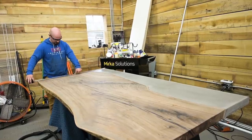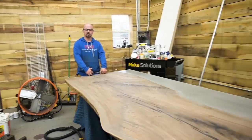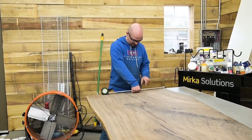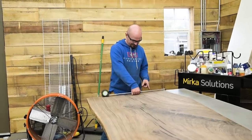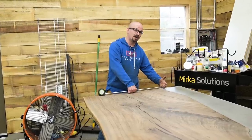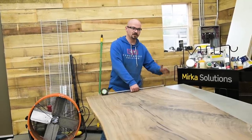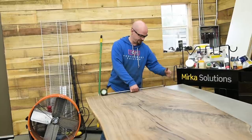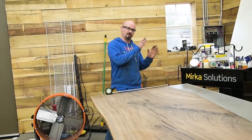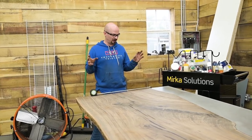So 44 inches — I can come in to 22 — this is my center. Because my base is 25 inches wide at the bottom, I basically have a 12.5-inch window on either side. According to this, my center of gravity is five inches off from the center of the table. The edge of the base on the bottom is actually still a good seven inches past the center of gravity. So even if someone's pushing or leaning on this, we've got plenty of support. I haven't done this much concrete lopsided on a slab before, so I just wanted to check. If you're doing mixed media or mixing materials where there might be a weight issue, it's really easy to check center of gravity — you just need something long enough that you can balance on.